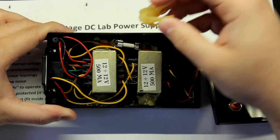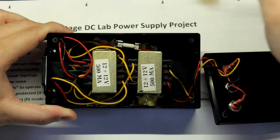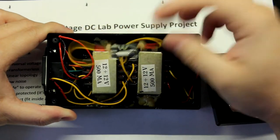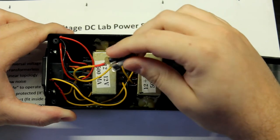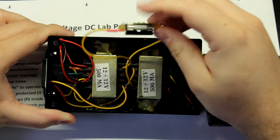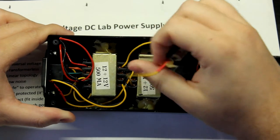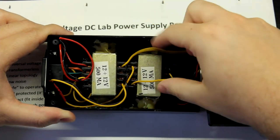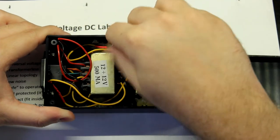Okay, so I've used some very cheap, crummy hot glue. There is a fuse here. It's again just flopping around. It's even a ceramic fuse. Oh, fancy. Again, just hot glued, and with time the thing just disintegrates. Oh, this is horrible. At least I thought about fusing it. Oh, and it's even worse because it is fused on the secondary. Oh, this is awful. I fused the secondary. I didn't fuse the primary. Oh, this is amazing.